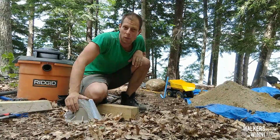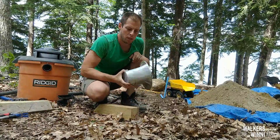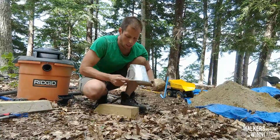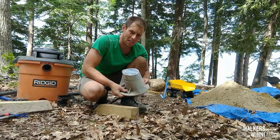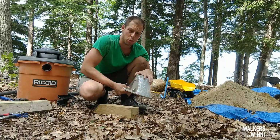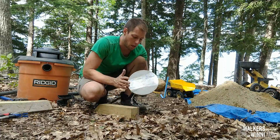I don't know if I adequately introduced the ready footings that we're using. Much like the bunkhouse, we're using these ready footings from a place in Rhode Island. These are as strong as concrete. They can hold 11,000 pounds before they fail. The funny thing about that is that the soil can only handle about 2,000 pounds, so these are going to push through the soil. So why use concrete footings when you can use engineered ones?